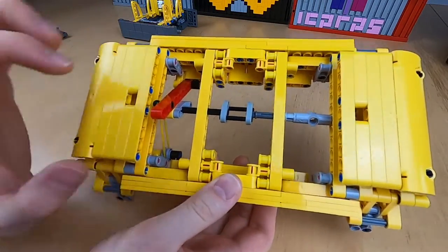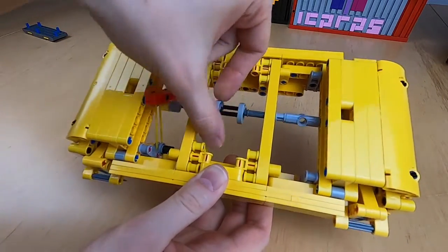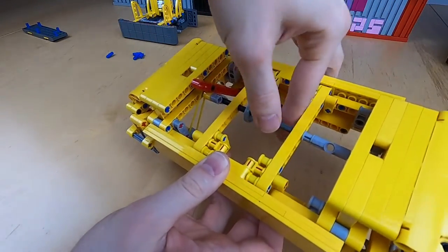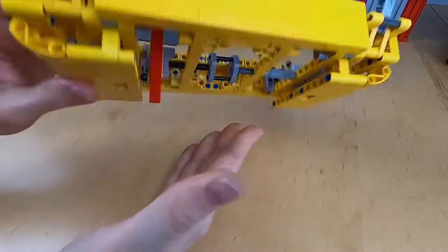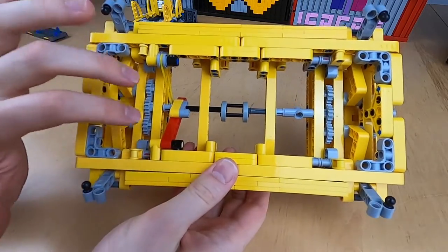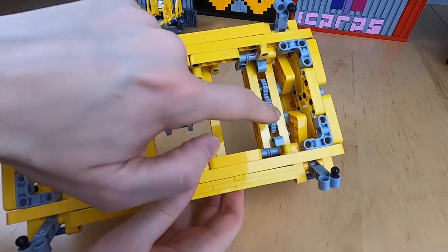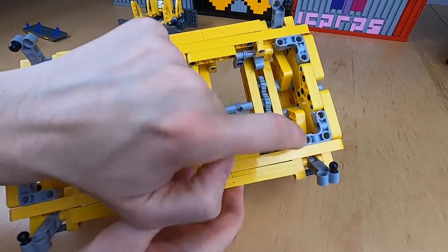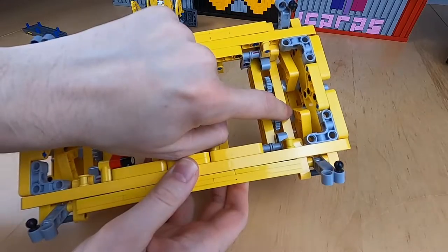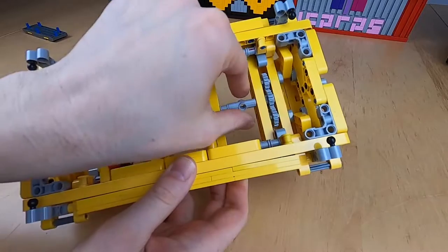The mechanism has a little pin which pushes the middle assembly upwards, giving half a revolution of the middle axle assembly. The red lift arm on the side is suspended by a silicone band in order to keep the axle in these half revolutions, so it goes up and down to lock into position. On the other side you can see we are using 16-tooth gears because they have low friction, and then we go out to the finger assembly in the corners using crankshaft parts to pull the fingers in and out.